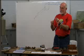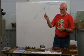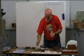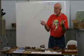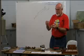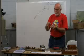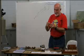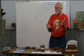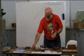That's a high-speed steel blade, and you can always pick the high speed because they have a little dab of yellow paint on this section here, which we call the tang, and that goes into the handle. We can still buy wooden handles like this, or you can buy quite nice modern plastic ones. And the modern plastic ones, all you have to do is put them in a microwave, and they've got a special plastic inside the handle. The plastic goes soft and you just push the blade in, and when it cools down, it's solid as a rock. So easy to do a modern tool these days.